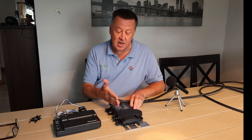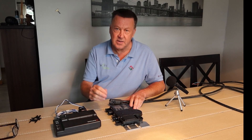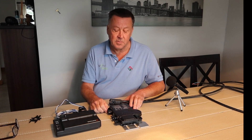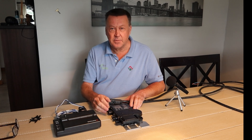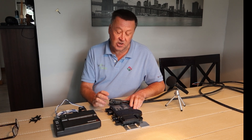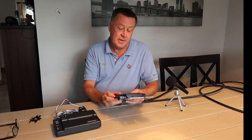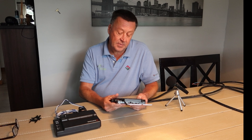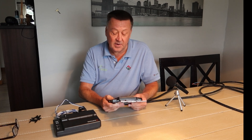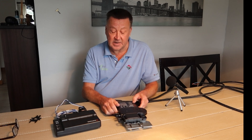We're still using Victron inverters on the back end. We still have load shedding in this country — basically the grid can't supply the full demand, so they cut the power off — which means we need battery capacity to run the sites. Victron actually integrates with Enphase, and it can be reported like an AC inverter. An AC PV can be reported just like a Fronius device on the VRM portal, so we're able to actually combine both technologies.